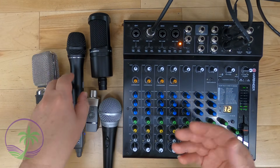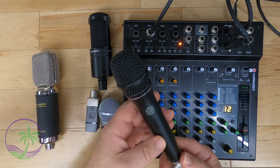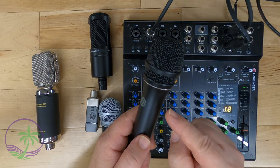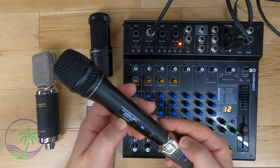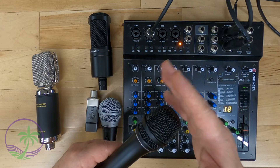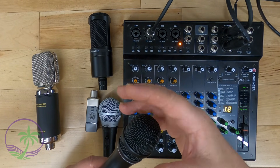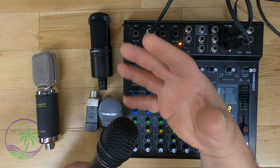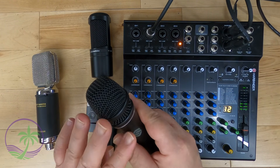Now, just like the hypercardioid microphone I'm talking into, you do get microphones like this as well. This happens to be from Sterling — it is the P30. The P30 from Sterling is a very impressive piece of hardware because inside this dynamic microphone is a micro amplifier — a mini preamplifier built right into the unit. You can tell because when the light's on, we're powered up. It needs phantom power to make it work. Why? Instead of being restricted to just the energy of your voice going into the microphone, that phantom power is going to make this supercharged. It's going to be able to pick up more depth, more distance, more range from around it — all directional, hypercardioid. It's going to sound fuller, richer, and more detailed, even though it's a dynamic microphone.